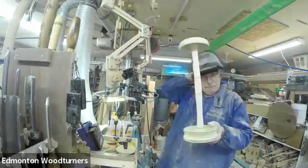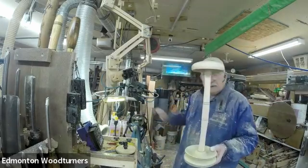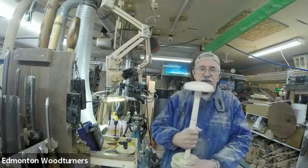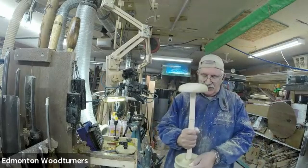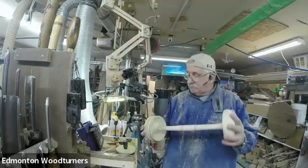Okay, there we go. One wig stand's done. And like I was saying earlier, I would make each one of the pieces in a batch. So I'd normally make, you know, let's say 8 or 10 spindles. Then I do 8 or 10 bases, and then I do 8 or 10 tops. And inside of a couple hours, I'd have wig stands ready for glue up.